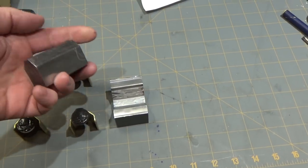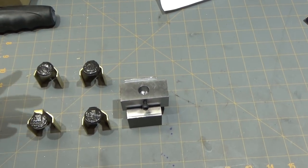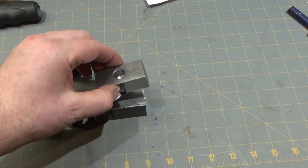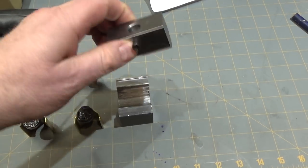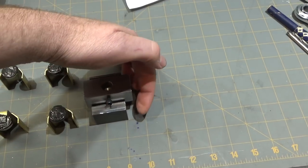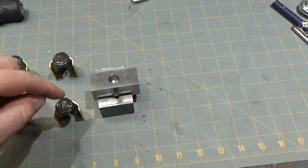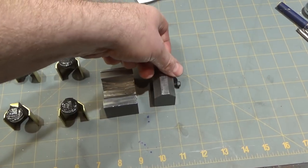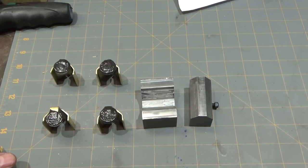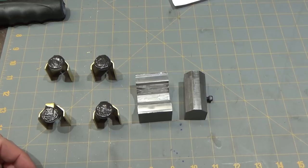So, definitely would make this differently in the future, I think. With more experience, this would have wings that would have pins that would align it with this, so you could just stick a piece of material in and down it would go. I'd overlap it with this piece, and I would extend this piece out and fold this end piece over, so I wouldn't have to do it by hand, because you could do it all in one operation without any difficulty. But this was my first ever attempt, so I'm not too unhappy. Let's go try these on the lathe and see how they fit.